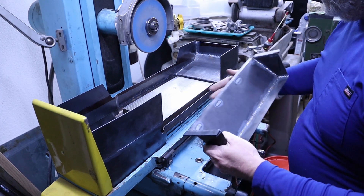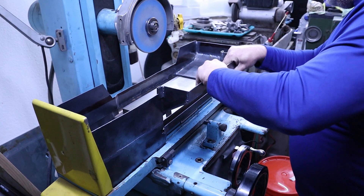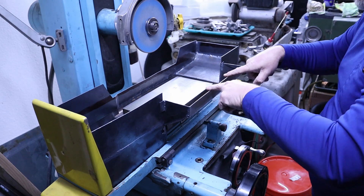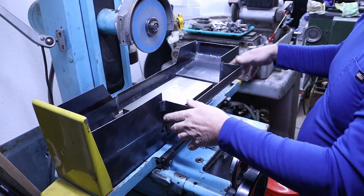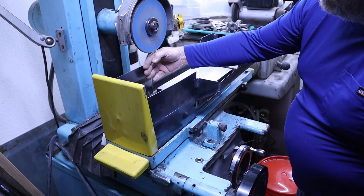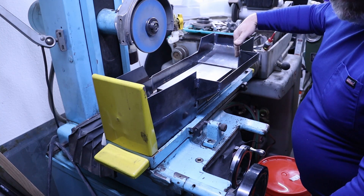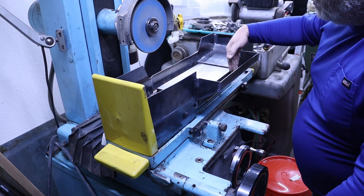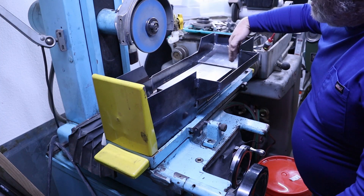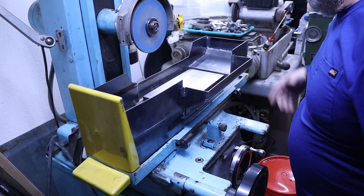This is just the front guard, which slides in. I have these two catches here and then some catches on the bottom as well, so that once it's in, it's going to flex — the whole metal piece is going to flex — but it's completely aligned. This gives me full range of motion, at least up to the edge of the wheel with the table all the way forward, and about the same on the other side. I may have to modify it as I can bring the wheel a little bit beyond the table, and once I get the guard fabricated for the front it may hit here. There may be some other changes to make, but the base guard is as it is.